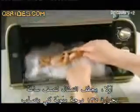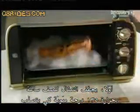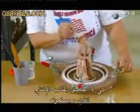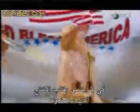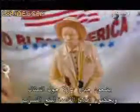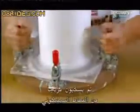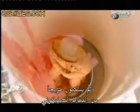First, the sculpture bakes for 30 minutes at 135 degrees Celsius to harden it. Then workers cover it with a thin layer of releasing agent so it won't stick to the production mold they'll now make. They place a wall around the piece, tightly seal the base to prevent leaks, then pour in a silicone rubber mix.